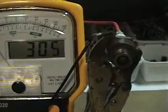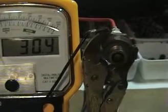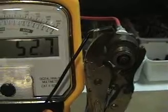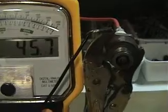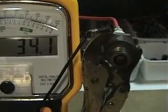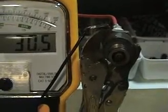There's one spark event. Recharged. Discharge. Missed that spark event. There's another spark event. So it's just at the point where it does make a spark event — it takes 46 volts at 22 microfarads to make a high voltage spark at that gap.